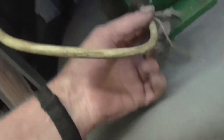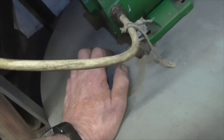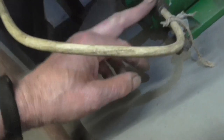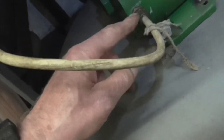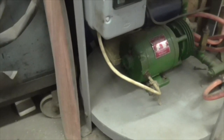Right, folks. It's all on. One pyro gland converted to a stuffing gland because, of course, it's an old motor, it's an old rig, and that's a 3/4 conduit thread and not a 20mm. So, drilled it out, put a couple of O-rings in there, clamped it up, works beautifully. Right, job finished. Bye now.